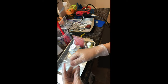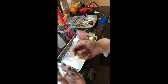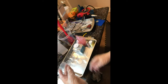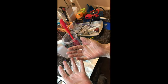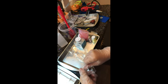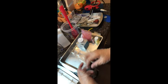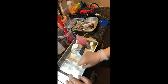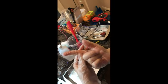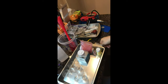But I just wanted to see if any of this was uncured, because a good hint that maybe my new batch of gloves are not working well with the silicone is if when I've finished the cups are kind of gooey, because anything that touches my gloves, if it stops the curing process, it will be all over the cups. And I know that I haven't got any quality issues like that popping up so far. It has happened with some experiments before, but not since I discovered that it doesn't work with all gloves. Because obviously if I'm pressing something into the mold with my finger, that bit of silicone won't cure, and I'll just end up with a gooey mold. Right.